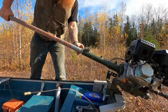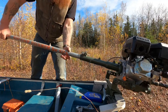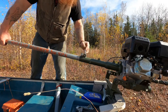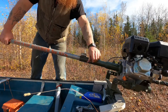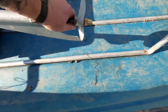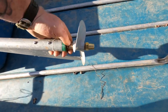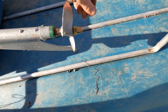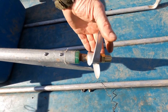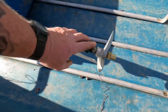I put a little mark on mine so I know where it's good to go. There's a greaser and some screws here — you just line that up with the split, and then crank these down. Temple said to take this shaft and pull it back and forth — there should be no play in it. When you put the prop on, this is a tapered shaft, so you just tighten it up snug. You're not trying to crank it on there because it's tapered — it'll split. It did come with a spare prop too, which is pretty sweet.